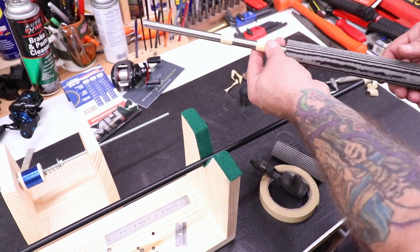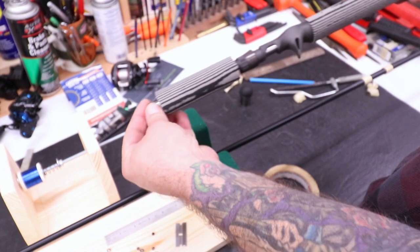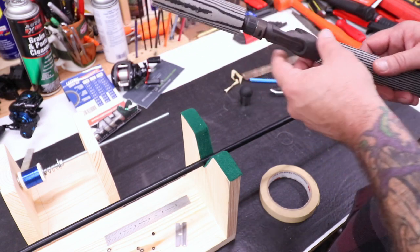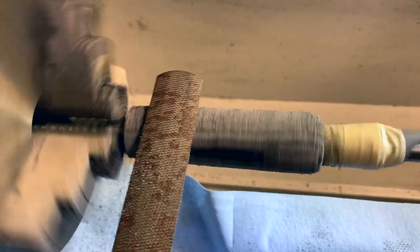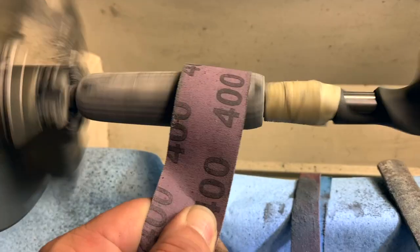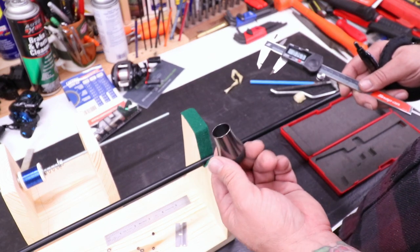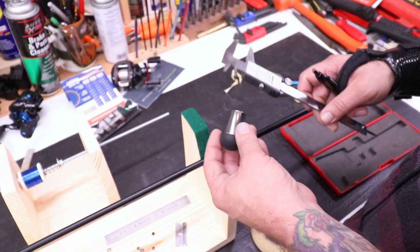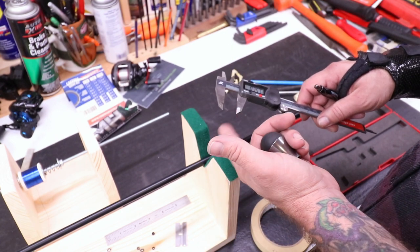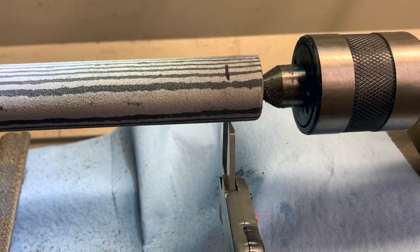Basically what I've done is I've mocked this up, even with the tape, so it gets a nice snug fit. I'm going to put this in the lathe and start shaping this down. I might put some tape around the reel seat just so I don't nick it with any sandpaper as this thing's spinning. So we've been contouring the grips down, but now I need to get this butt cap installed. It just so happens the depth and the width are about the same, and I'm told I can actually cut that EVA foam with this here. Let's go take some measurements and see if we can make this work.